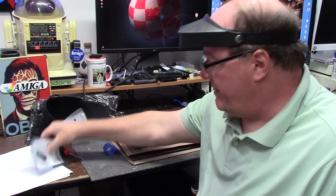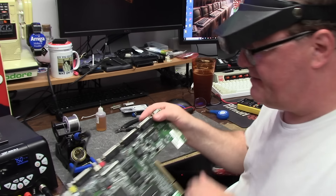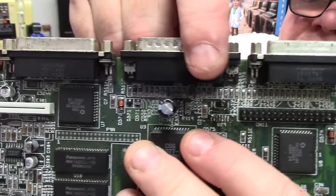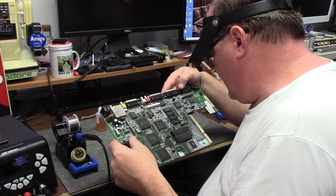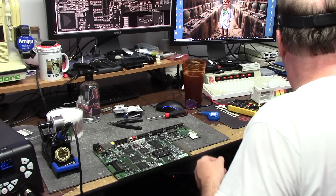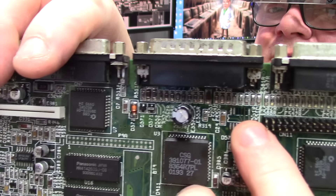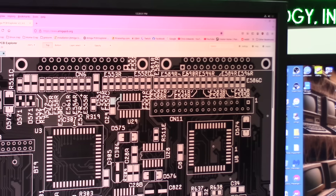We'll fire up Amiga PCB — a second set of eyes, even a microscope for a third. We have spare chips for both. Getting U29 out — the second solder attempt obliterated all the pads on the top. You can see there — one, two, three — and some solder balls underneath. It looks like we're missing four pads. Chip quick may have lifted a leg, or it happened during the second extraction.